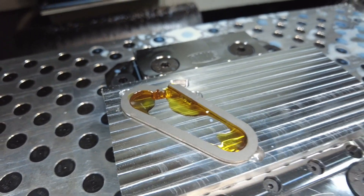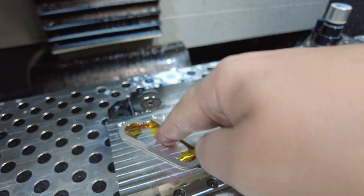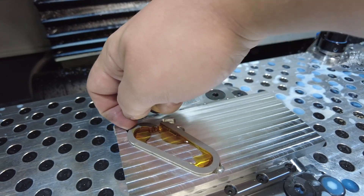I'm going to try the same thing again but with a different resin this time. This is actually a 3D printing resin — it's still UV cure. This resin is designed for investment casting, specifically lost resin casting, and I bought it thinking it would be easier to melt off a part. But what I didn't realize is that it doesn't actually melt — it just burns at like 1,300 degrees Fahrenheit, which isn't particularly helpful to me right now. But we'll try it and see if it's stickier than the other resin. I accidentally used way too much resin, but the part doesn't feel loose, so we'll see.